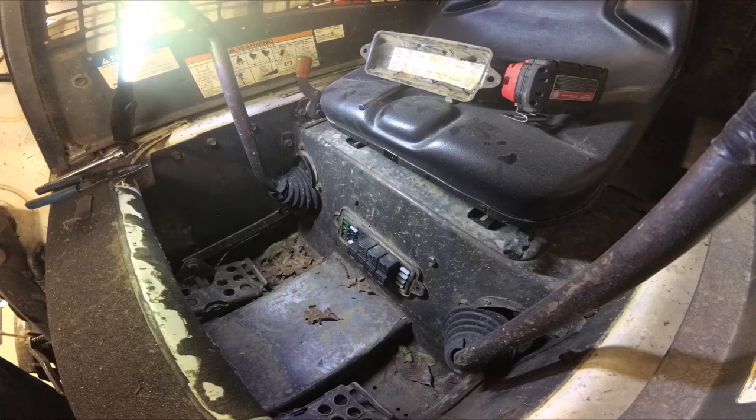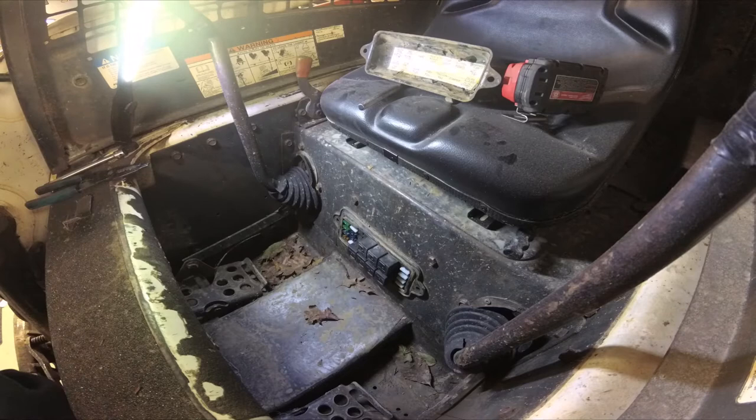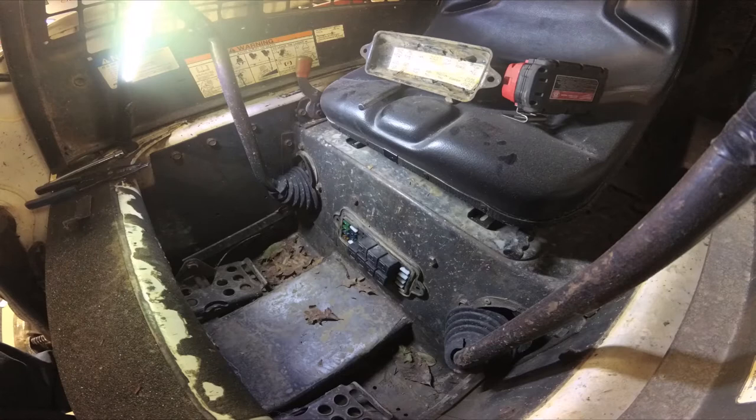Let's find the key switch here and see what happens. I can hear the fuel pump. Heard something clacking. The glow plug light is lit up and the seat belt warning is lit up. The glow plug light just shut off — so they're working. The relay is working. No flash. They're back on again. They're cycling. Definitely cycling.